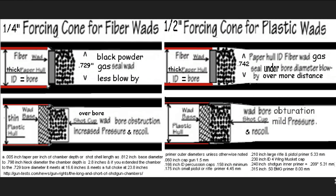We're going to start with the idea of using a gun with forcing cones made for black powder, using fiber wads, made by starting with a piece of metal pipe — welded, extruded, or drawn over a mandrel — with an inner diameter matching the bore diameter. The chamber was drilled with an ordinary drill bit, like a boring or reaming bit today, to the correct diameter with a specific taper, starting at about .81 inches and tapering down to .79 or .78 inches.